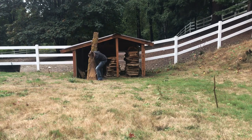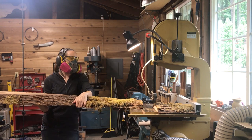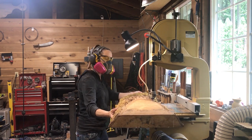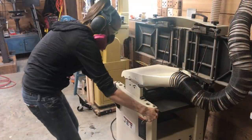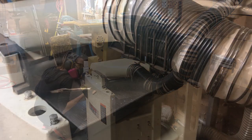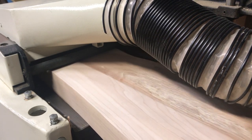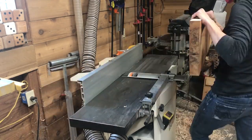I'm hitting up my maple slabs for wood. This has saved me so much money and time shopping for wood. Of course, if you don't have the tools to dimension your lumber, you can always buy it already to size. You'll need a piece of maple at least 17 and a quarter inches wide by 17 inches long and one and three quarter inches thick, and a piece of walnut at least one and a half inches wide by 17 inches long and one and three quarter inches thick.